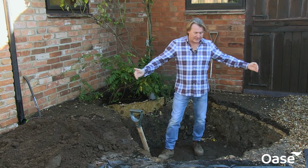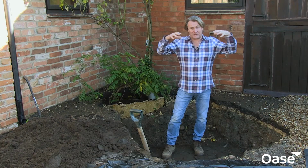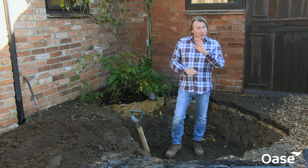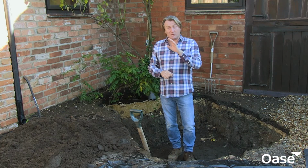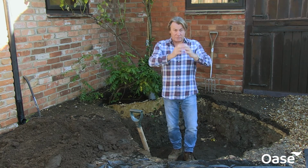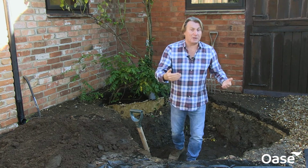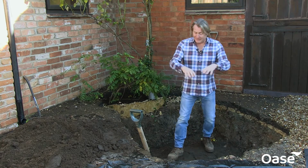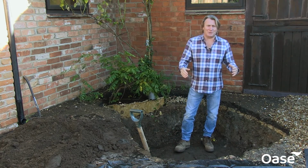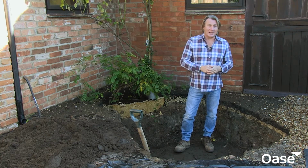So by creating a hole that's big enough for all the water that splashes out to be recollected and worked through, it's a really good principle. And also some water features, when you turn them off, don't hold the water in their sections. It all just drains back into the sump, and if the sump isn't big enough, of course that spills over the side. So making sure you've got a good space to be able to hold all the water you need to go up through your water feature and fall back in and collect it is really good.